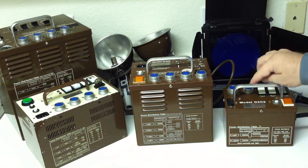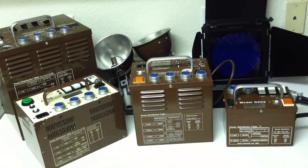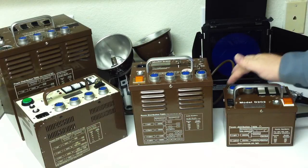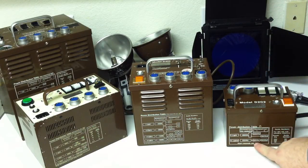Or if you want to pop it over to channel two, it's 150 watt-seconds in asymmetrical. So you have two options for one light: 200 or 150. With two lights, that changes a bit — you have 100 and 100 in symmetrical, and in asymmetrical mode, 150.